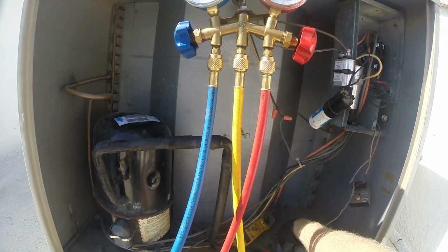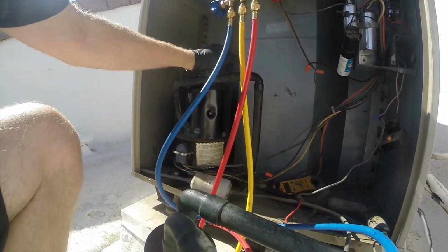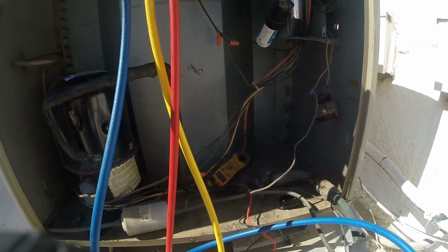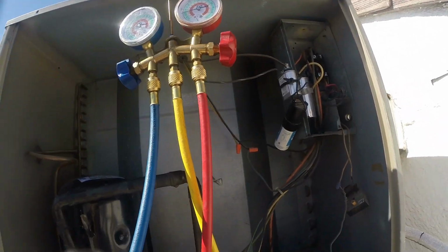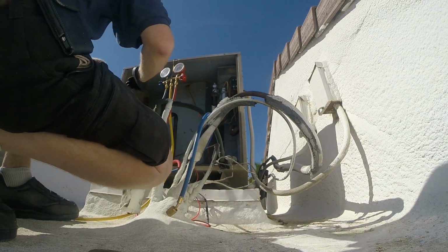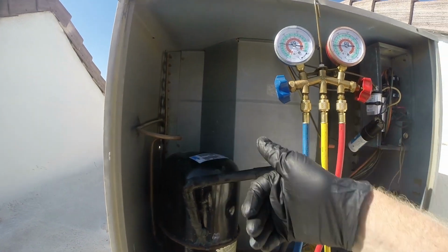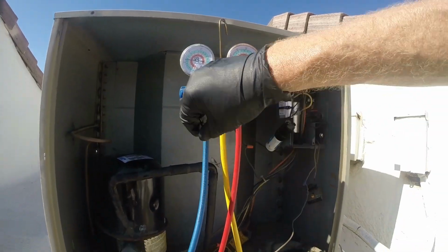We're above freezing on the coil, nice and cold. We're removing a lot of heat from the unit, keeping the compressor cold, but not so much refrigerant that it has to run a high amp draw. We're now at 10.6 amps. It's a good deal. Recovering the refrigerant that way wasn't perfect. The compressor may go. You know, we need to know that. This one's been replaced before. Worst case scenario, we need to change out the compressor. This would be a pretty clean change out. Detach here, detach there. Not too bad if it came down to it. But hopefully we don't need to go there.